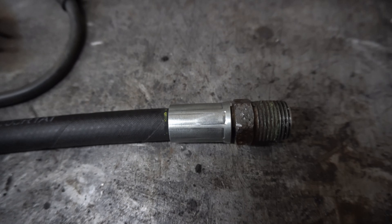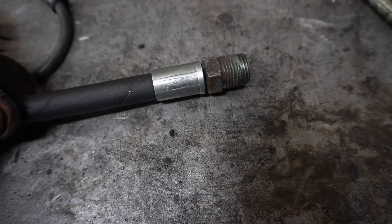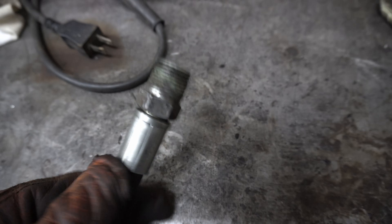Here's the final hydraulic crimp. I don't go all the way to the top just because it kind of flares it — it pushes that front piece up into the groove where the other one was, so it does lock it in there. There you go — if you're in a pinch. I've had a couple of these and they've never broken, even if they've been a little rough. Never had any problems with them. That's how I reuse old fittings. If you want to see how this crimper from AliExpress works, I have another video on that. It's crucial that you can dial in your diameter for these fittings, and this machine lets me do that since all the name brand ones have fixed dead-stop dies. Like and subscribe and check out my other videos. Thanks.